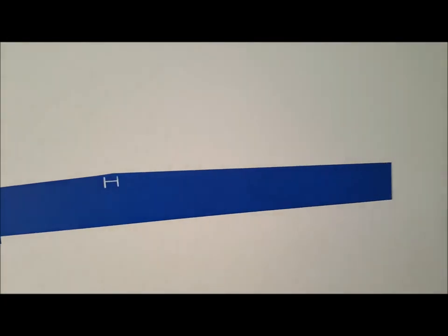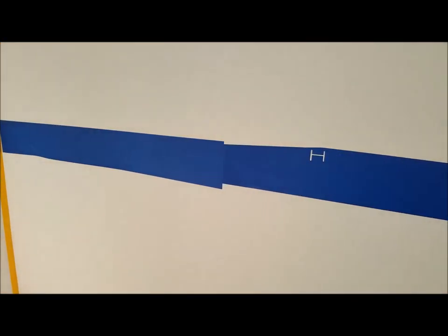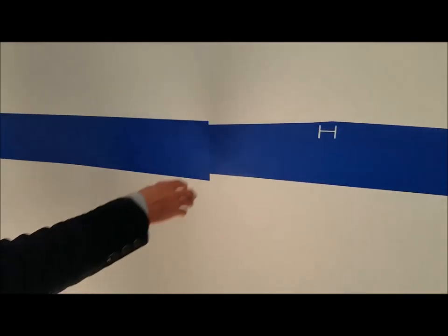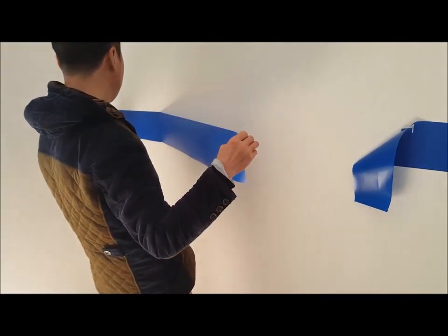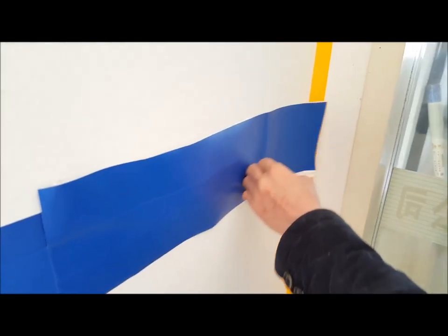After we finish the pasting, we use a roller to make sure whether the height of the two sides is consistent. If it's not pasted well, we can tear it off and repaste it. After three parts were pasted, at last we can scrape off the extra part. Remember, at the edge of the interface part, there is an overlap of a millimeter.